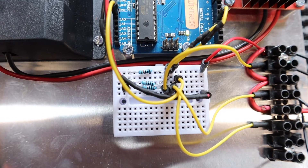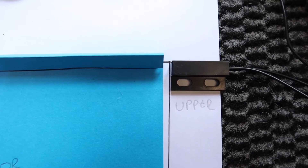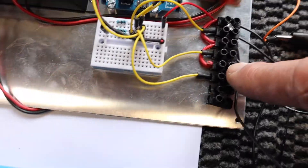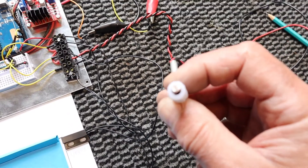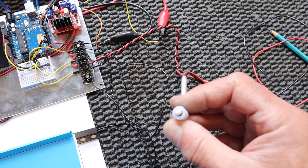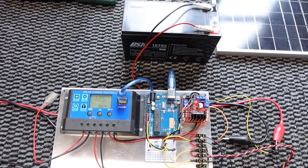I've tried to clean it up a little bit by shortening the wires. The top output comes down to the upper reed switch, the next connection goes to the lower reed switch, and the third one goes all the way to the photoresistor. The photoresistor will point outside of the coop to detect the sun, and I'll seal it into the wood with silicon. So there are all the parts of the system — pretty simple. I haven't shown you the motor yet, but I'll do that now.